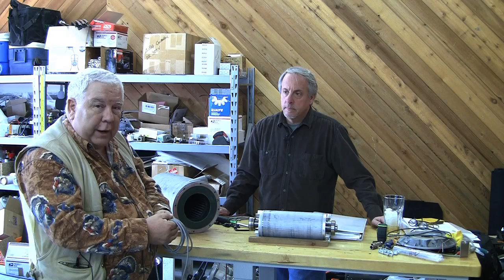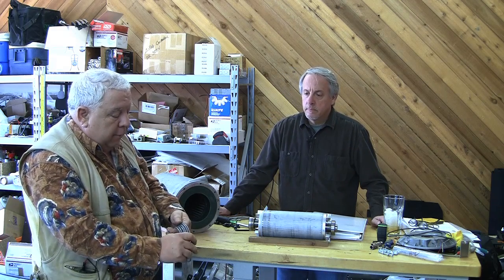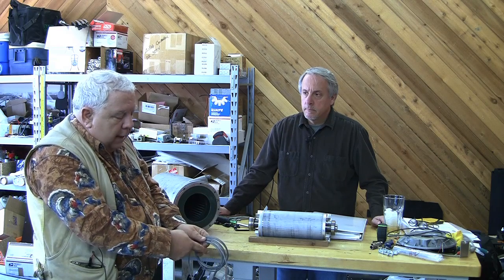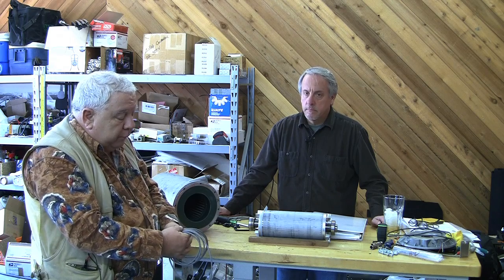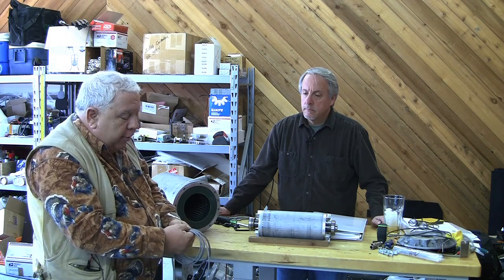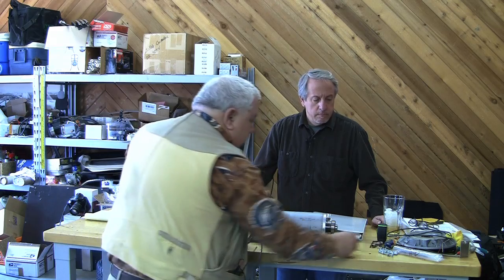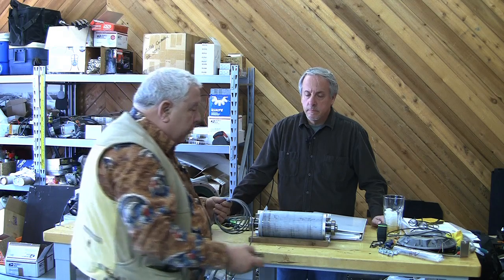There is a way to concentrate the lines of magnetic flux in this magnetic field. The field will go out one end of the coil at one pole and the opposite pole at the other end. You can concentrate that by having a piece of metal inside your coil instead of air, which tends to focus the magnetic lines of flux, particularly at the two ends of the coil.